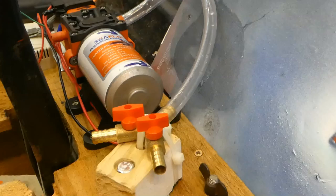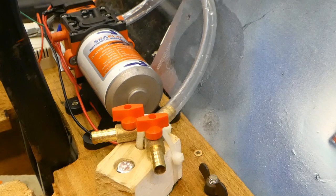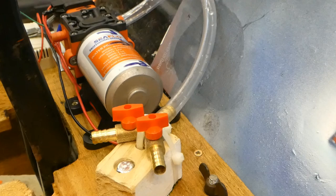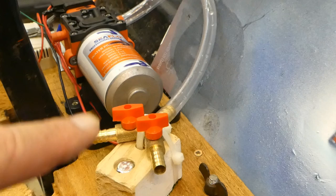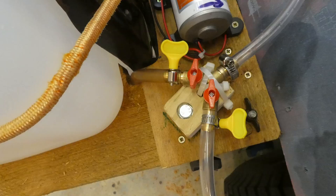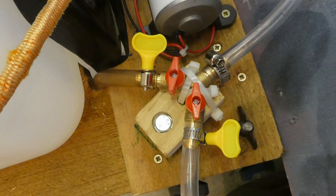Here's the explanation of the outlet coming out of the pump. The tubing from the pump output comes into a Y connector, and I'm using a double shut-off valve. One side will be used to spray the spray bar on the back of the unit, but the other one I can connect to a remote wand. I use yellow butterfly screw clamps for connections that may need to be removed occasionally, and regular screw clamps for more permanent connections. All the tubing and connections are 3/8-inch, matching the input and output connections on the pump itself.